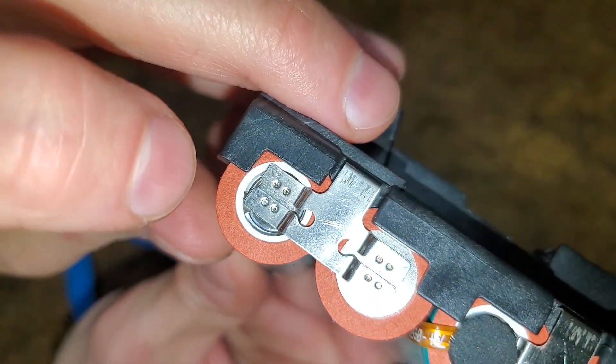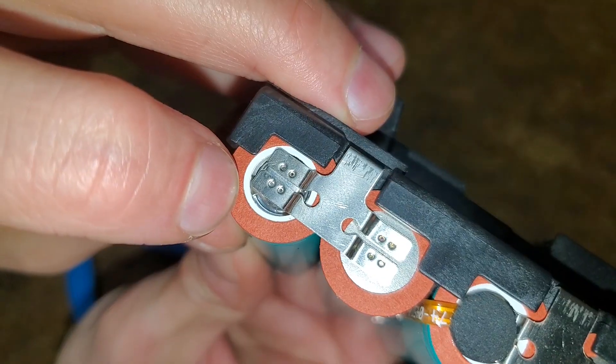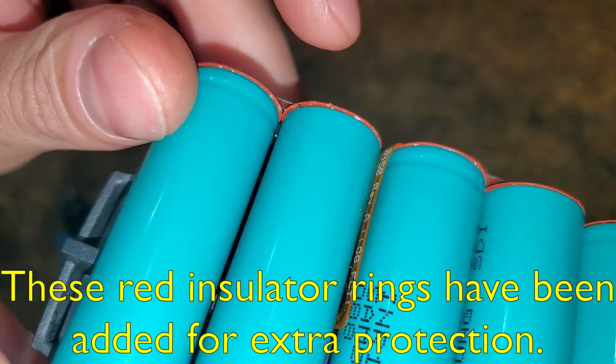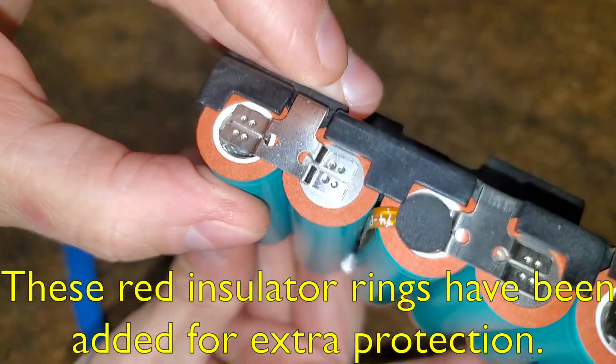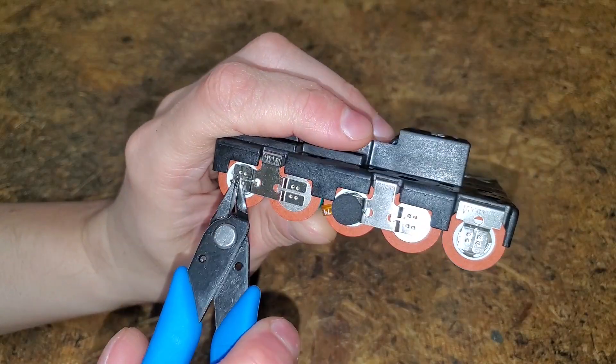On the positive side, the outside edge that's covered in the colored plastic is negative. If you cut through that plastic covering and the metal part of your tool touches the positive center and the negative edge at the same time, it would create a direct short that could cause the cell to explode due to thermal runaway.